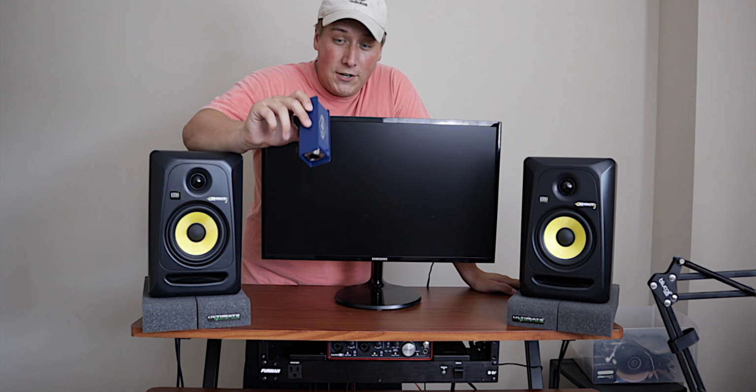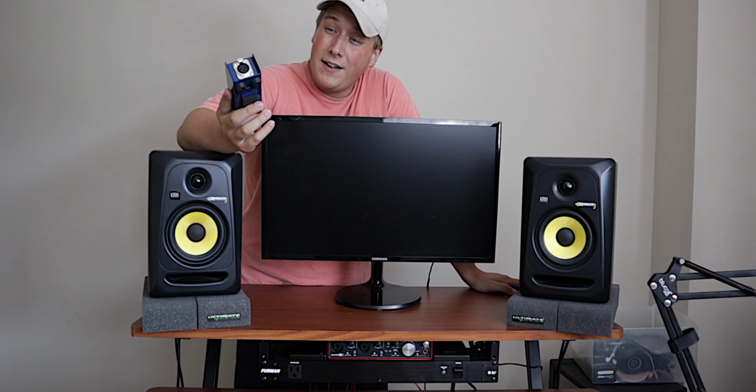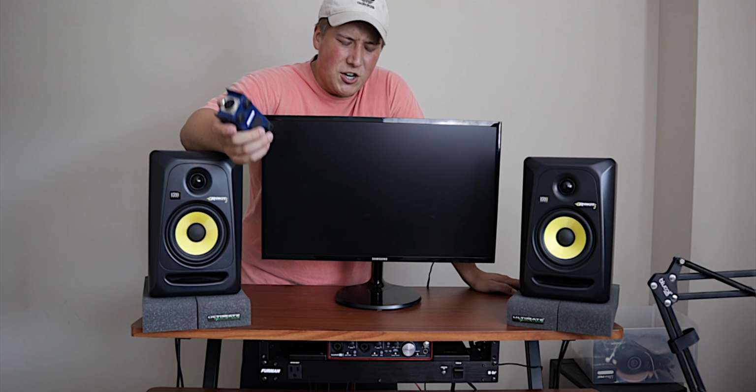Another thing you kind of need to have with that microphone though is a Cloudlifter. Basically, this takes your input level and amplifies it very cleanly without introducing any kind of noise. When you're using a dynamic microphone, if you're turning your gain up, you're going to start getting gain noise in order to get the levels you need. This allows you to use those dynamic microphones without introducing any kind of artificial noise and still getting those gain levels that you need.